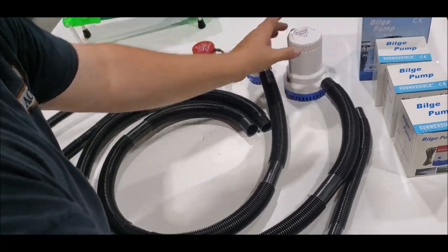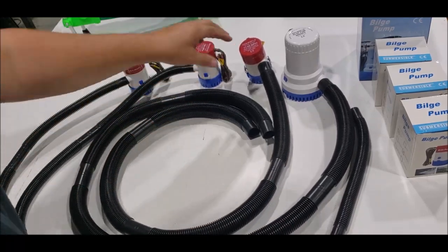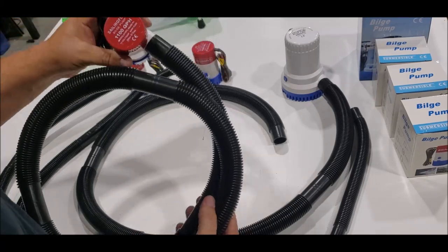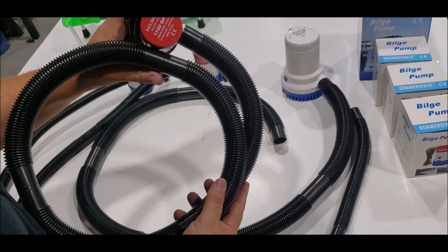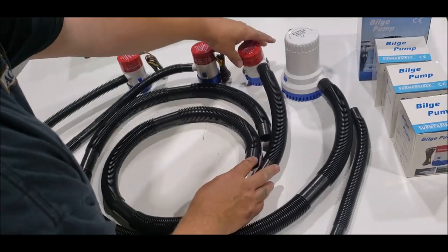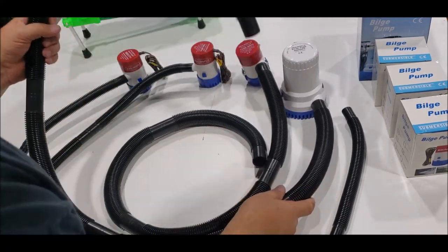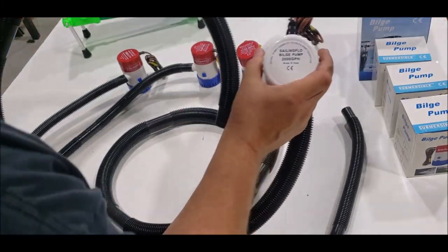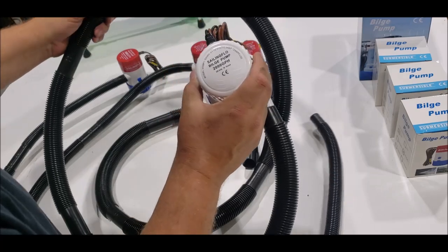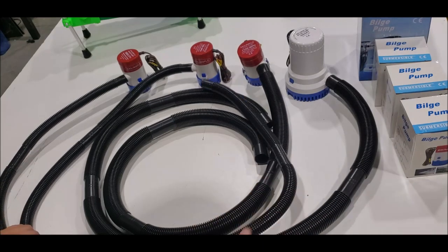With a 2000 pump, I would put a valve in there to help you control the flow — you're going to be a lot happier. The only time you'd run the 1100 in a traditional cube stack is if they were all micro mats and you were doing super slow cleanups. We offer it, but then you're limited on your feed rate. Dream mats can feed a lot more, capture a lot more, and go faster — more material means more gold at the end of the day. The 2000 pump is what you want.